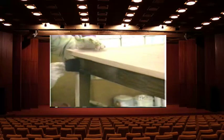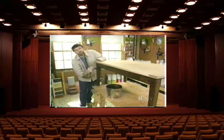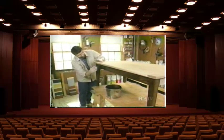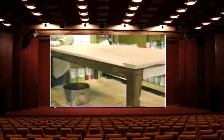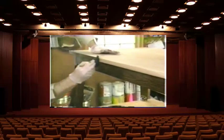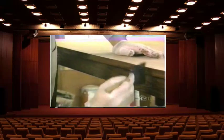The antique we saw in England was very dark, and we kind of like that look. So what I'm doing here is applying a coat of an oil-based stain that the manufacturer refers to as English walnut. We'll coat the whole piece, let it dry, wipe off any excess, and touch it up as necessary. Then I'll let it cure at least overnight, and then we'll put on some of that magic wax.